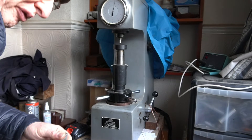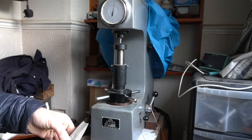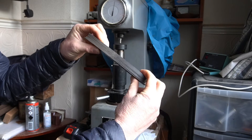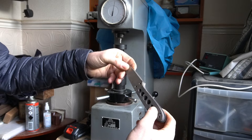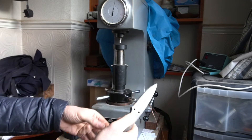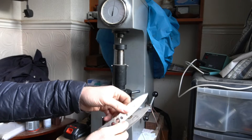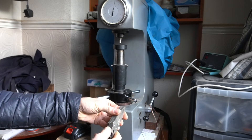Time to do some Rockwell testing now. They've all come out super flat - look, they are really flat. That's thanks to the real positive clamping pressure that I use. And you haven't got to be in such a hurry with getting the blades cooled, because they actually will harden using air cooling methods. So you've got plenty of time.